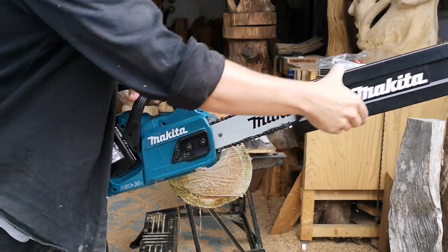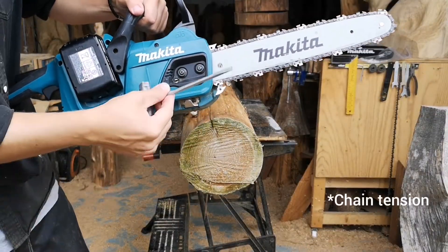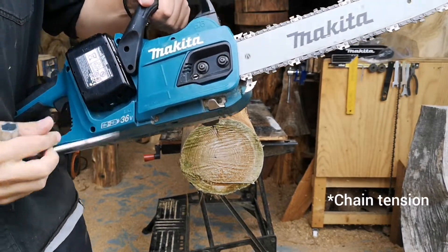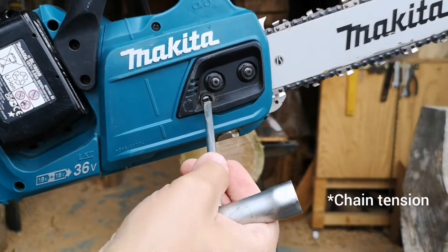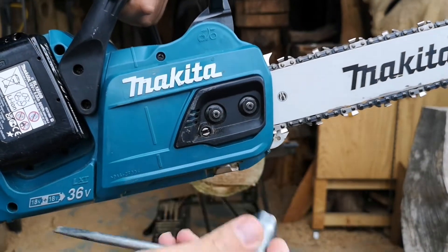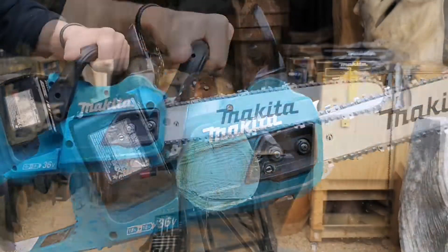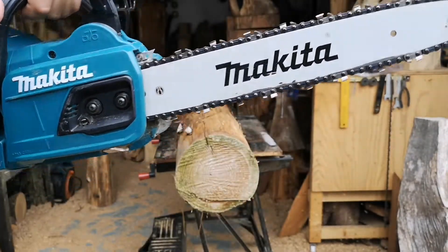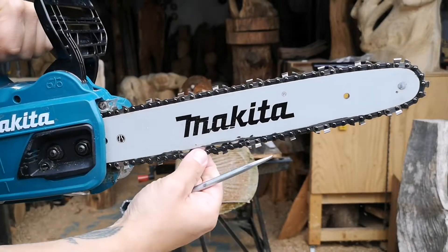You've got the chainsaw sleeve. To alter the chain tension you're going to need your combination socket tool or combination spanner. This little adjustment tension screw is what you're going to need — it tightens and loosens your chain. Ideally you want to loosen these off, make your adjustment, then tighten them back up before you start. Always check you've got a good chain tension — you don't want to run a saw loose or too tight.